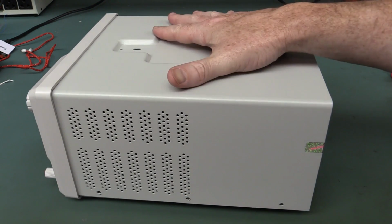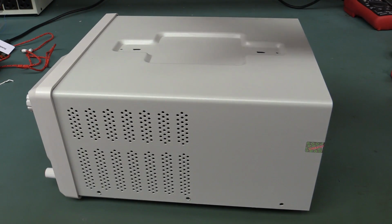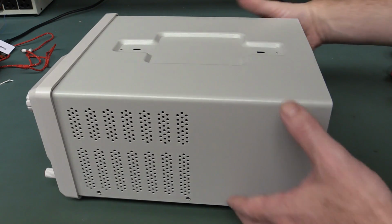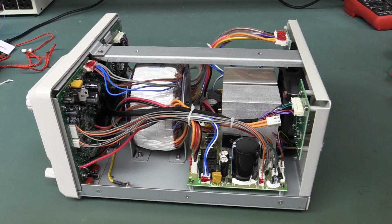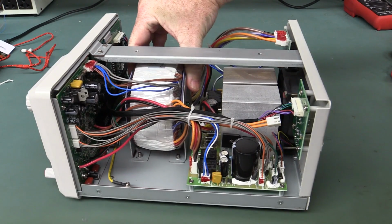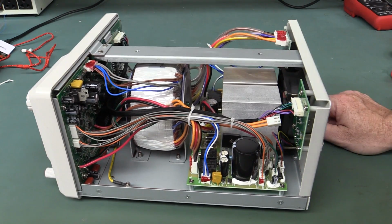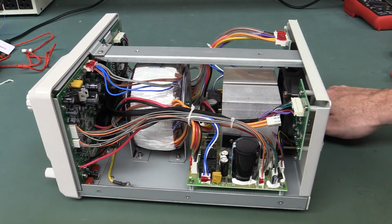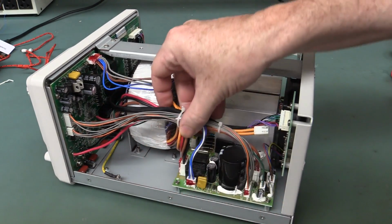So the quality in a power supply is all about the mains transformer, the quality and brand of capacitor used, the thermals, the internal wiring, the construction, whether it's nicely loomed and things like that. So let's give it a bell. Ta-da! We're in, and we've got a nice big toroid here. Look at that. That's a monster. I like that. That's mounted vertically, but is that a shorted turn? Oh, I hope not, but anyway, we'll get to that.